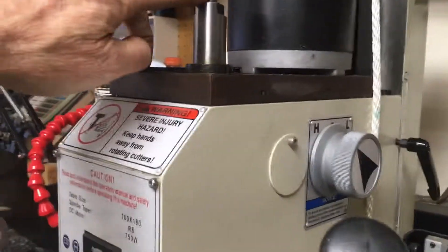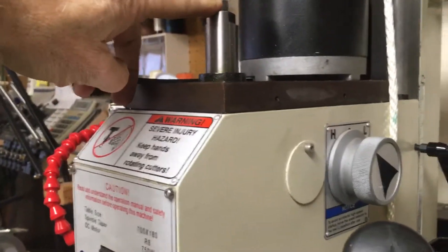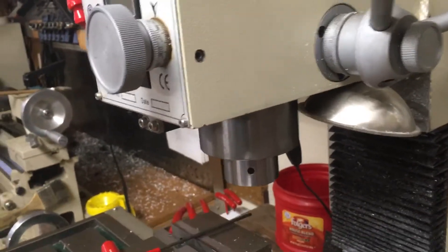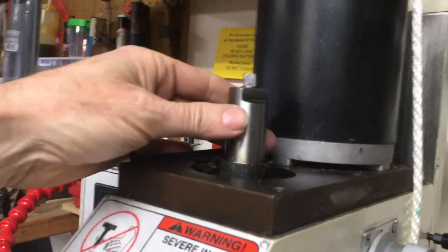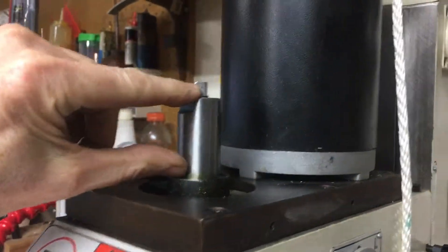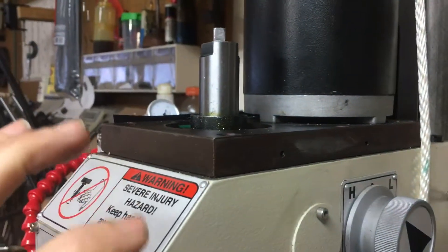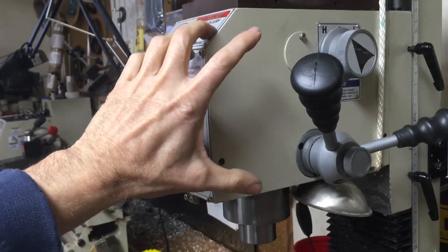You've got the four-sided top of that screw there that you hold with a small wrench, and then you put the pin in here to change and remove collets, end mills, and cutters. But this part of it — if you hold the shaft from the bottom, you can turn this piece right here off. I would have guessed that's setting the preload on the bearings, so it's squeezing the top bearing into the race and the bottom bearing up from the bottom.